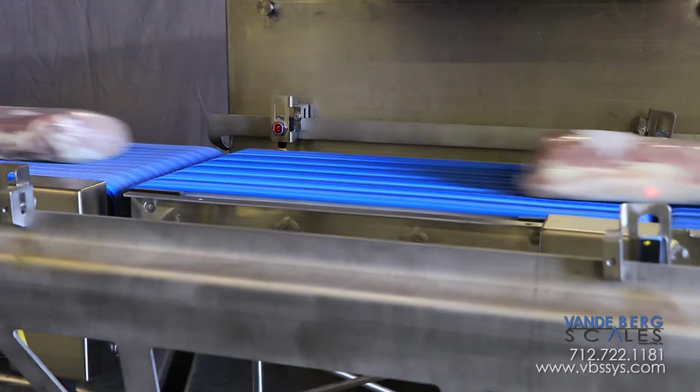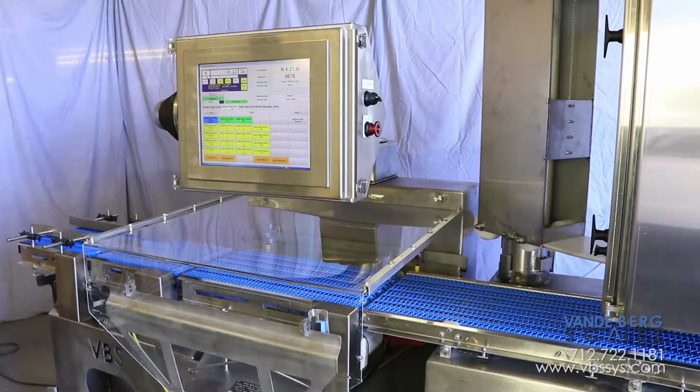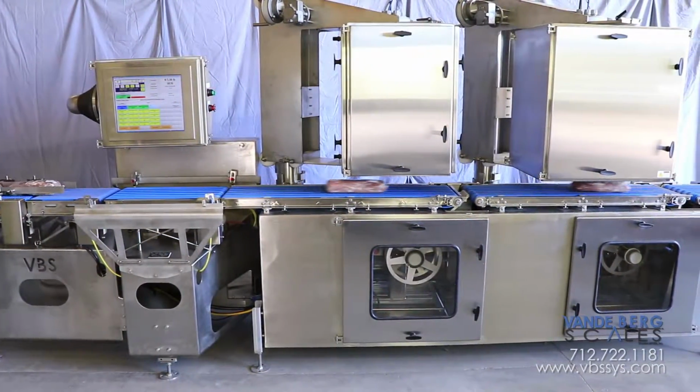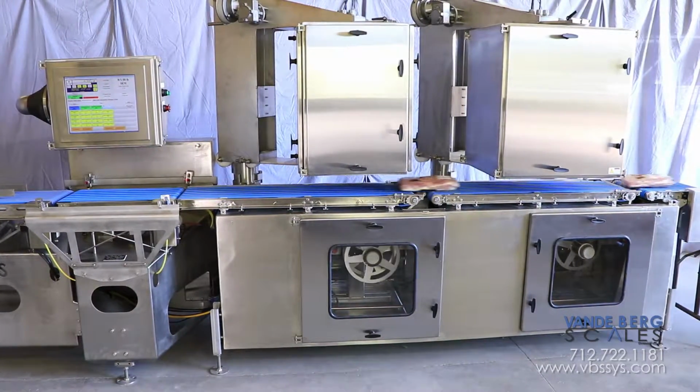A conveyor scale with PhotoEyes senses the leading and trailing edge of the package for proper weighment. A transparent draft shield allows product visibility while keeping error-inducing drafts off the scale. This weight price labeler utilizes a two top printer setup that labels packages at industry standard speeds and capacities.